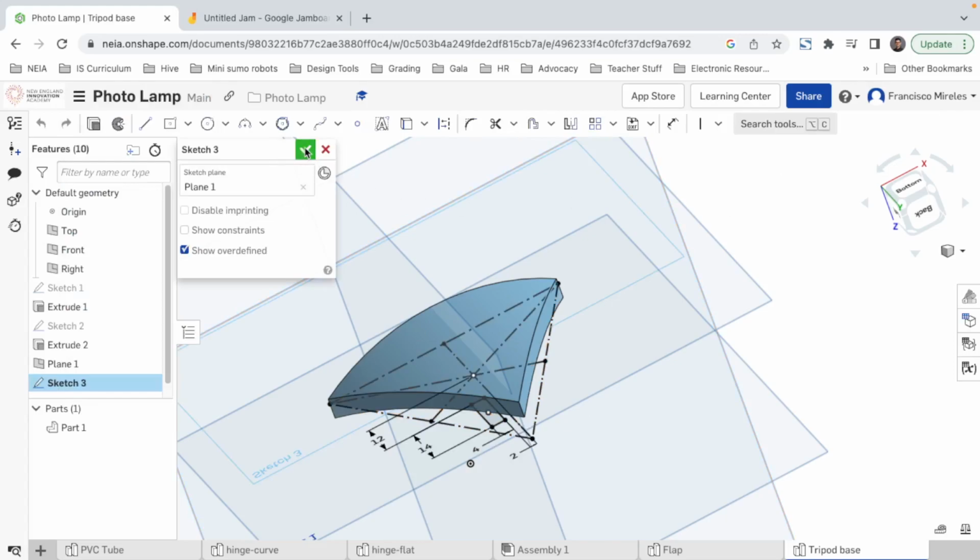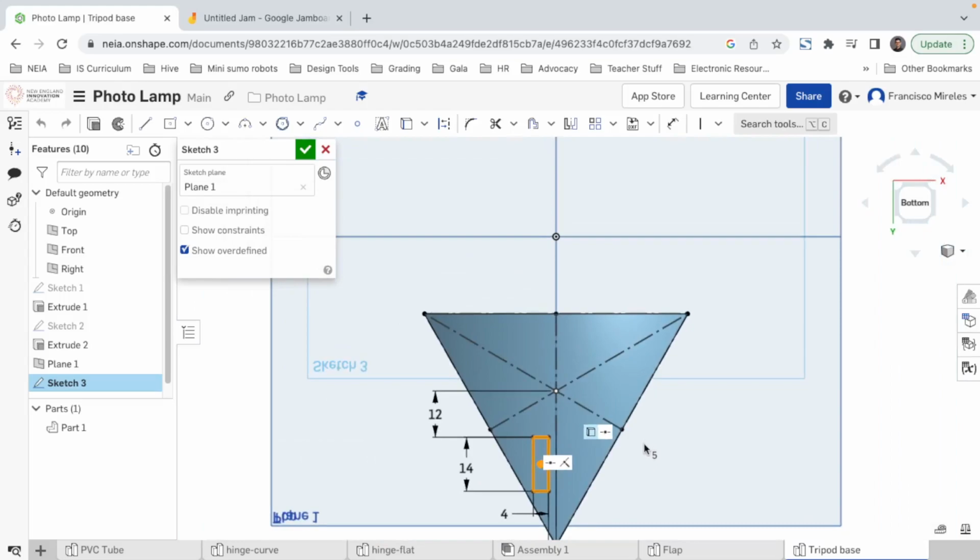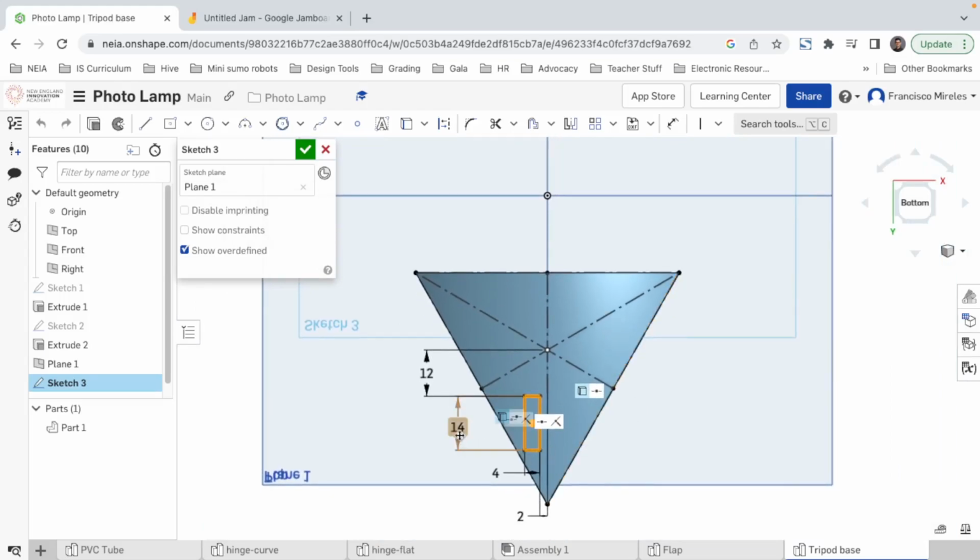And we're gonna learn how to use circular arrays and mirrors. So I'm gonna grab this. That's something really interesting. Why wouldn't you draw the same thing over and over? Well, because if you decide to change something, you would have to change it in all the other instances of that same thing. But if you do a mirror and you do an array, then they are all dependent on the original one. So if you only modify one, they would all change in real time. So that's what we're gonna do. We're gonna select this rectangle, this mirror line, we mirror, and there we go.